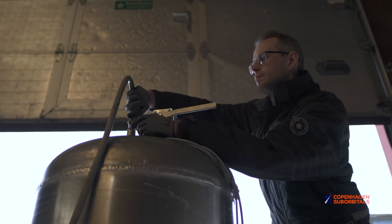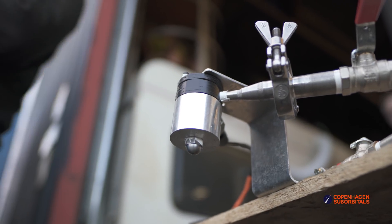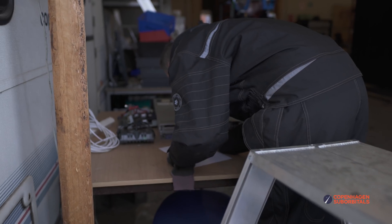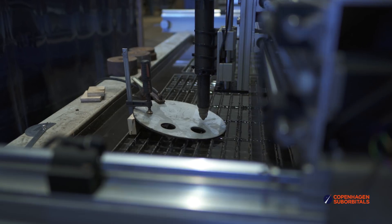In the meantime, we had Thomas and Thomas measuring more oil burner nozzles for our liquid nitrogen evaporator burner — loading up a tank with water, pressurizing it, letting water flow for a few minutes, weighing it, writing the results down, and repeating it. At the same time, Jakob was running our CNC plasma cutter next door.